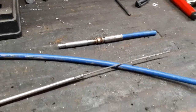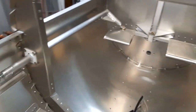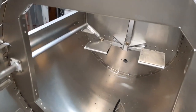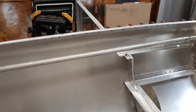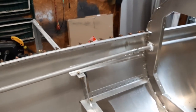I'm glad I'm not flying with one of these again. I much prefer the rod — it's big, it's in the open, I can see it, it's strong but lightweight. If you had a cable like that for the rudder and it broke, you'd be in a mess. But if something broke down at the pedal with the rod system, you could literally reach out and run your rudder by hand if you absolutely had to — which I thought was kind of cool. That is why I like this system better. I hope that answers your question, and thanks for watching!